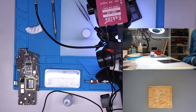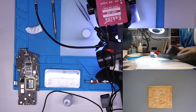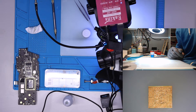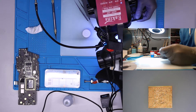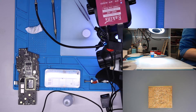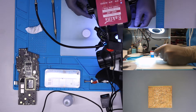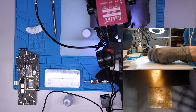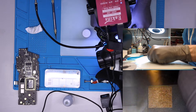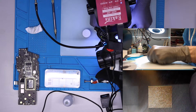Hello LogiWiki, today I'm going to show you a new reballing method. I'm not sure if I'm the first one, but at least as far as I know I've never seen it, so it might be helpful. This is just PMU — power management IC for the M1 CPU. This one I find rather hard to reball with normal methods, so after I failed a few times miserably, I wanted to try something new, and this was so much better than the normal hot air method.